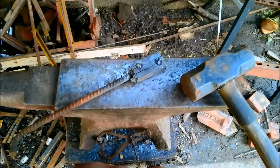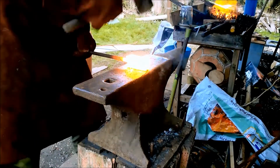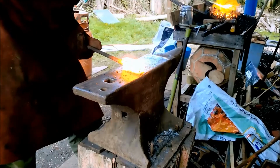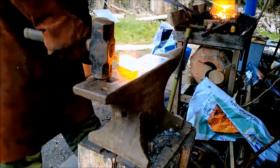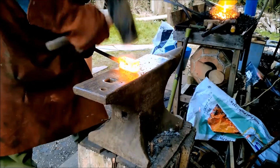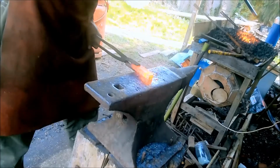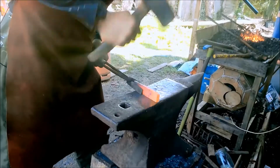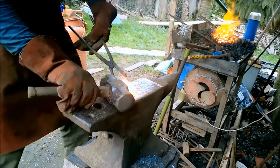At this point I decided to also throw in a small chunk saved from a previous failure. With 8 layers on the 2 outside lumps, and 6 in the middle one, the layer count is 20 after this weld. Another weld doubles the number of layers up to 40.